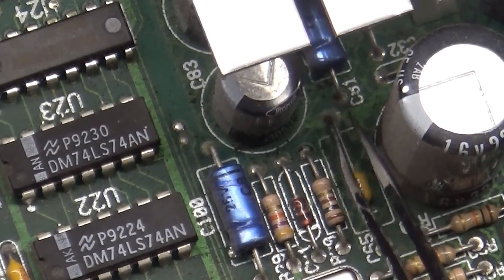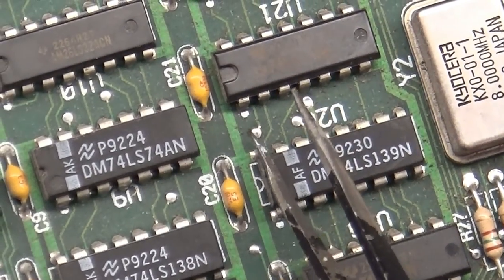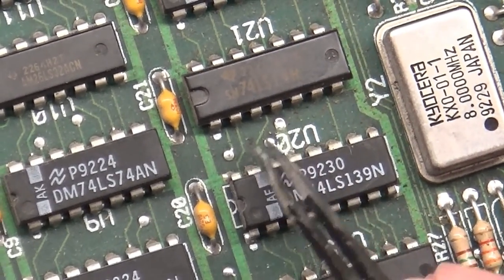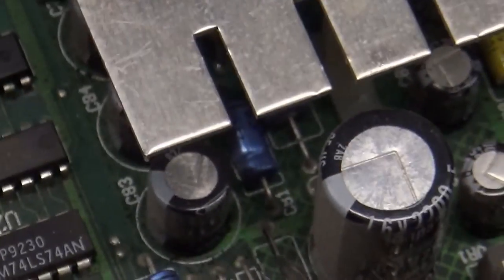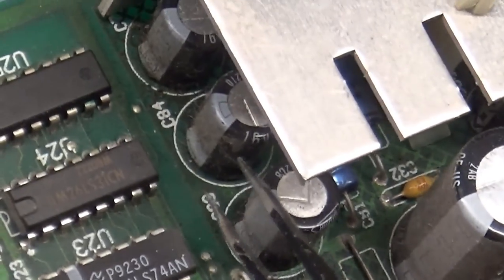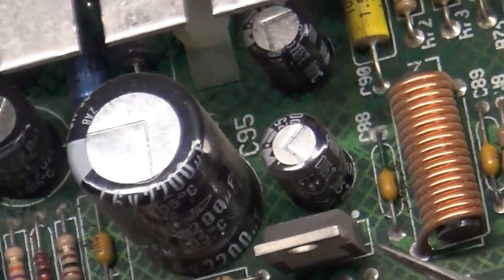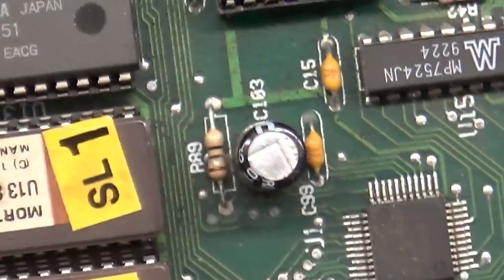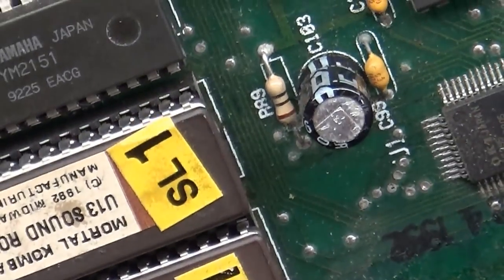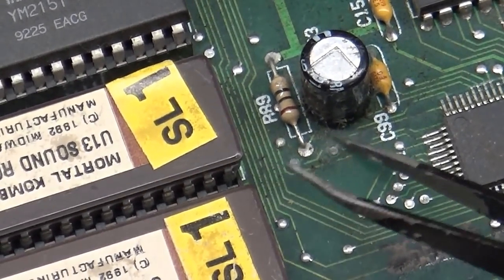And if you look at the solder joints here, they're dull and dark, as opposed to this solder joint, or this via here, which is nice and shiny. All these are nice and shiny joints. If we look over here, it's dim and gray and dull. So this cap is leaking, this cap is leaking, this cap is leaking, and I'm sure the rest of them are leaking as well. If we look down here at this one, you can see the same type of thing, all this dirt around here. So we've got some suspect trace damage here.